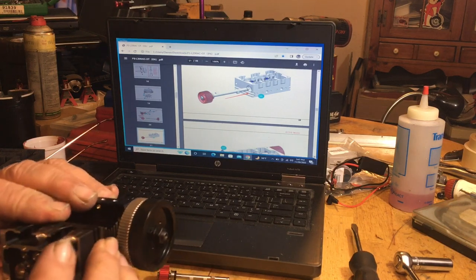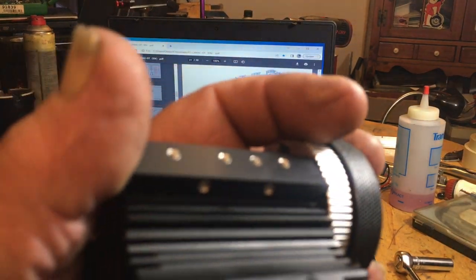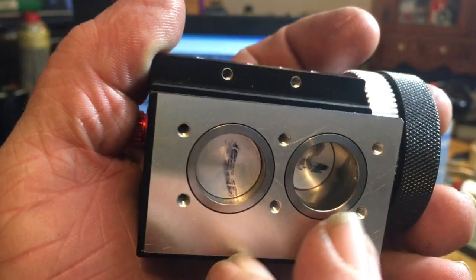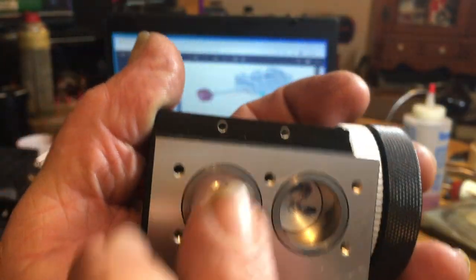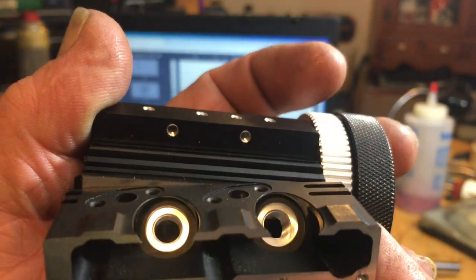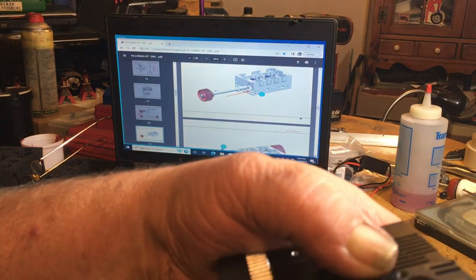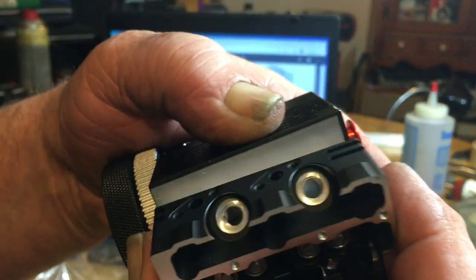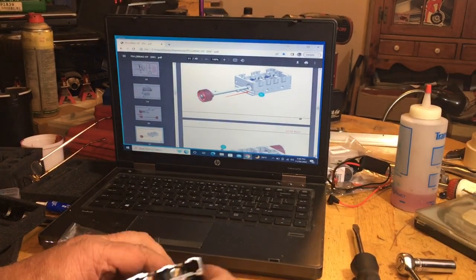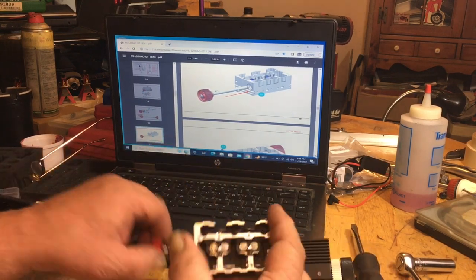it gives you a super nice opening inside to the cylinders. Because you see it's offset here. It's wider here than it is here. But yet they brought the glow plugs super tight within the cylinder there. Because I know a lot of engines have them backwards and they're shielded over here, so there's like a little cave-in for some of the engines that I've dealt with in the past. So I'm glad to see that. I'm very happy.